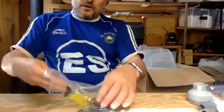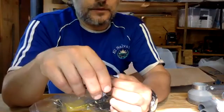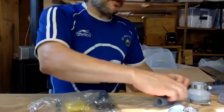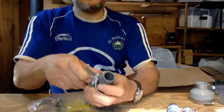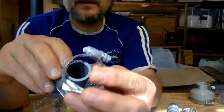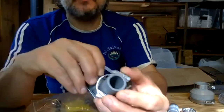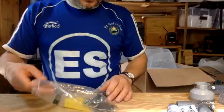And then your tubing is actually secured to the angle iron when it's inside the toilet. There's this small worm drive clamp that goes on top of here, and it's basically just to make sure that it stays in place. Yep, perfect. So that's all set.